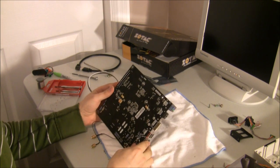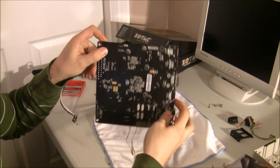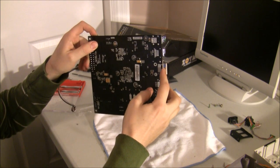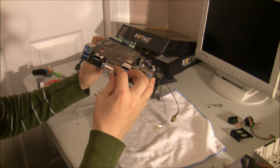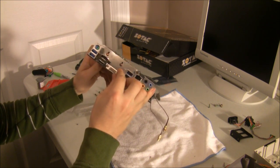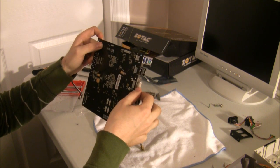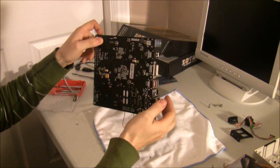I'm looking at the best way to save space inside this case. If you look at that profile, you'll see we've got quite a jet right here with that DVI, so I'm gonna get my soldering iron and desolder this DVI port, see if I can get that to come off cleanly. Since we won't be using the DVI port at all in this build, I should be able to heat those solder joints and get the DVI socket off to give us a little bit more room to work with.